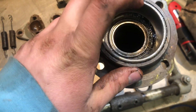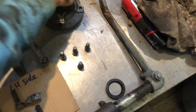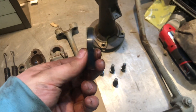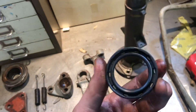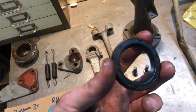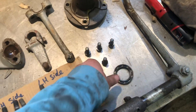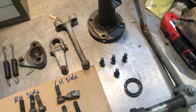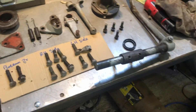The felt has just completely worn away with age. The next stage will be to tap this one out of the housing and insert a new seal — you can get them very easily and very cheaply; I think it costs about one pound. It's relatively easy, a lot of work for one little seal, but better than having all your transmission oil on the floor. That's all the relevant parts I've removed.